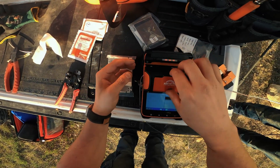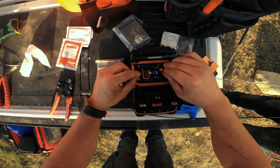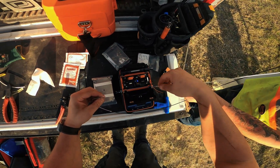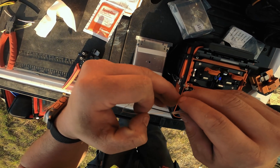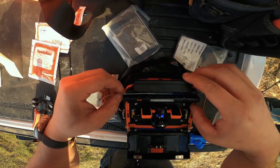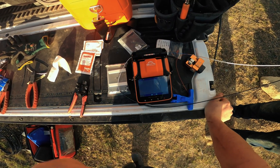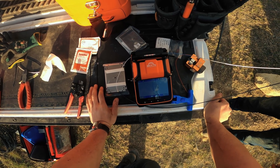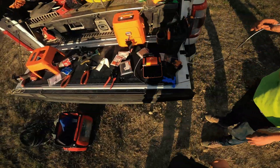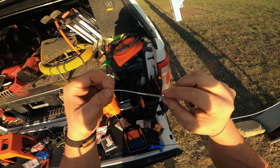So now we have to open this — it starts to preheat. Open that up. Want to be very careful here — open that, open that. Slide, hold right here. So we slide this over, being very careful. Center that and pop it right in there, and that heats up. This will shrink the heat tube — boom boom boom. As soon as it's done we put it into one of these splice trays and carefully wrap everything up. Looks like it's done. We have a successful fusion splice — 0 decibel loss. That's what we were looking for.